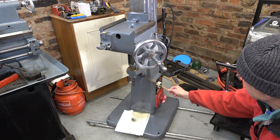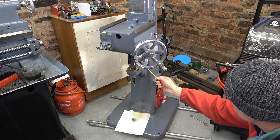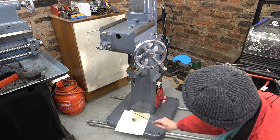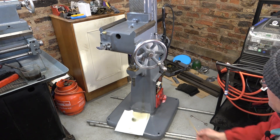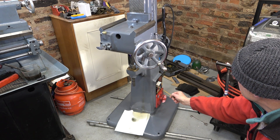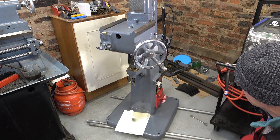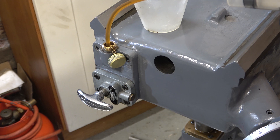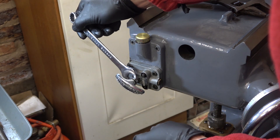I think you can see that we've got an oil leak — you can see the oil running down there, and it's here and all over here with drips underneath. I think it's running from this seal down here, drip drip drip. So I want to take this handle off and get this seal out and see if we can fix that. You might notice that the contactor plate is off again — that's not a video continuity fail, there might be some good news which I'll tell you about if it works out.